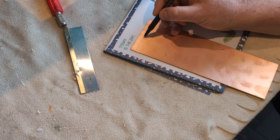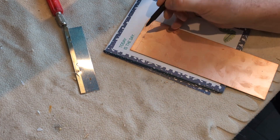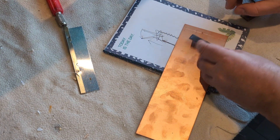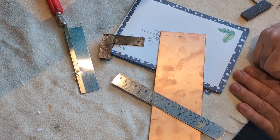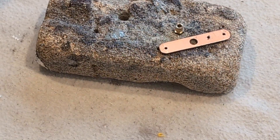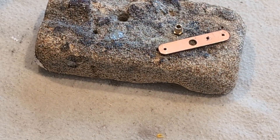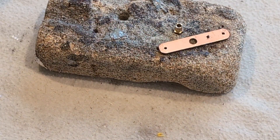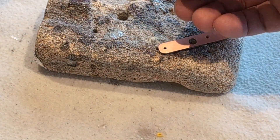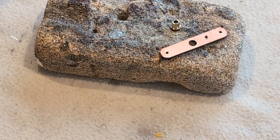That being said, I'm confident I can get them set up correctly. I'll have a tiller position here with another hole drilled that the pushrod can go to the servo. I simply need to cut that shape out and that will be the tiller arm for the rudder. Here we are back again — I've cut out the tiller. The two outer holes take the clevises that go to the pull-pull system, the inner hole goes to the pushrod and servo, and I've made a little boss that I'm about to solder to this tiller so a ball can go through with a washer to give a smooth action.